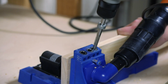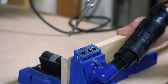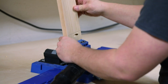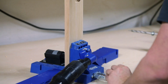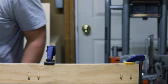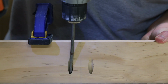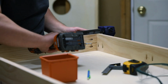The last thing we need to talk about here is the method of joinery. Again, tons of options. I went with pocket holes. It seemed appropriate given the materials. The simpler option would be to simply screw the frame together with regular screws. If you take that route, just make sure to pre-drill so that you don't split any of your pieces near the ends. Of course, if you're building your boards with something super high-end like Baltic birch, that might call for something fancier like box joints.